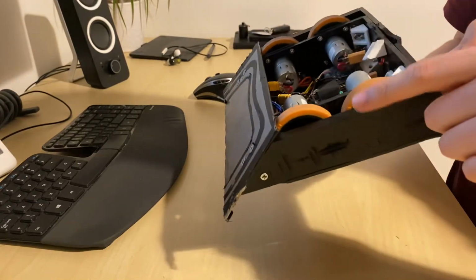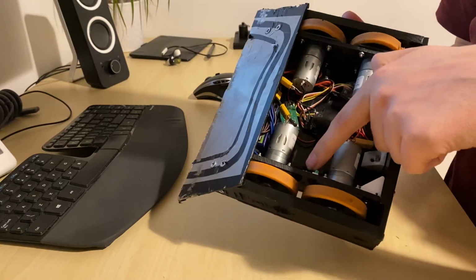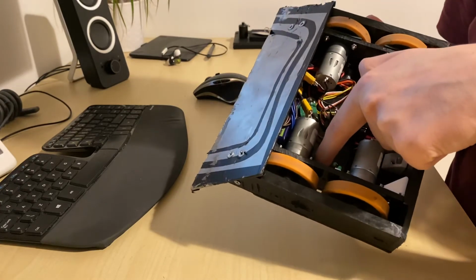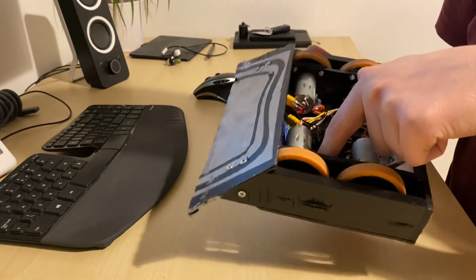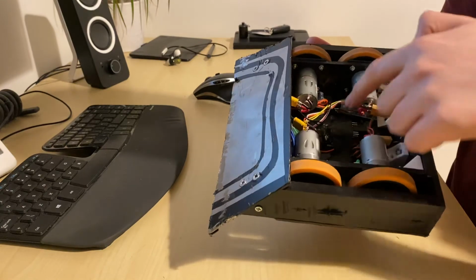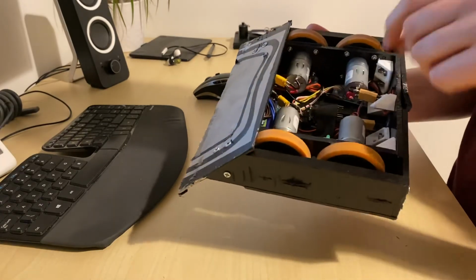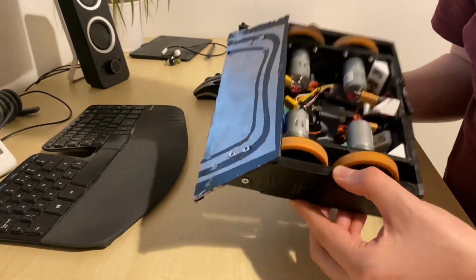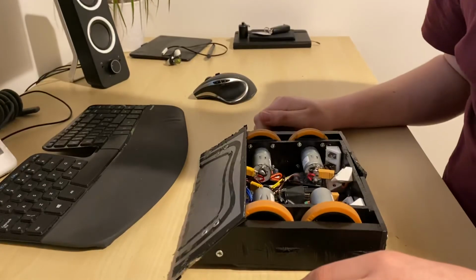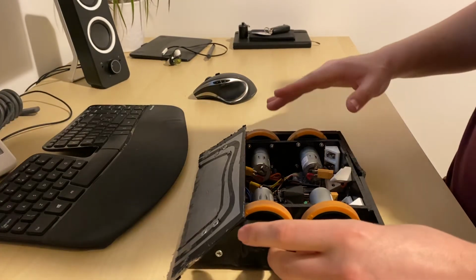The way the power distribution works, for whatever that's worth, the battery's up here. The positive wire from the battery goes out to one end of this link under here, and then it goes through the link, and then this gets split into 3 branches. One of those branches, the positive end of the branch, goes to one of the speed controllers, the other one goes to another speed controller, and the third one used to go to the speed controller for the weapon motor, but now goes to the BEC, and then those 3 branches are rejoined on the negative end of the battery. And there's a 4th branch that does the LED as well, so that's separate from everything else. So all 4 of those things are in parallel. If that's not the way to do it, then let us know. I'd love to know the correct way of doing that.